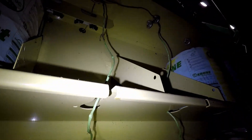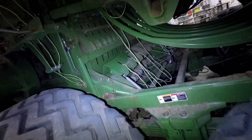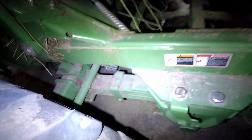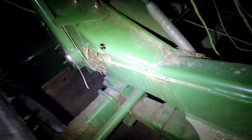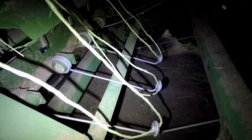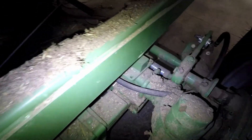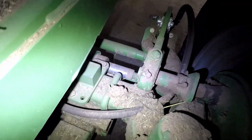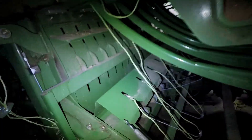This is our twine box. We have an awful lot of twine — we can carry a lot of twine, and it's all going to go together. It's super heavy-duty twine as well. Underneath, we've got lots of different things. This has actually got full suspension — it's got leaf spring walking beam suspension. And then it's actually got brakes on here. You can see the brakes right inside. There's our S-cam, like what a semi would have, and then this one's going to have an S-cam as well. Plus, it's going to actually be a steerable axle, so a lot of components on here that you're going to have to be checking on.